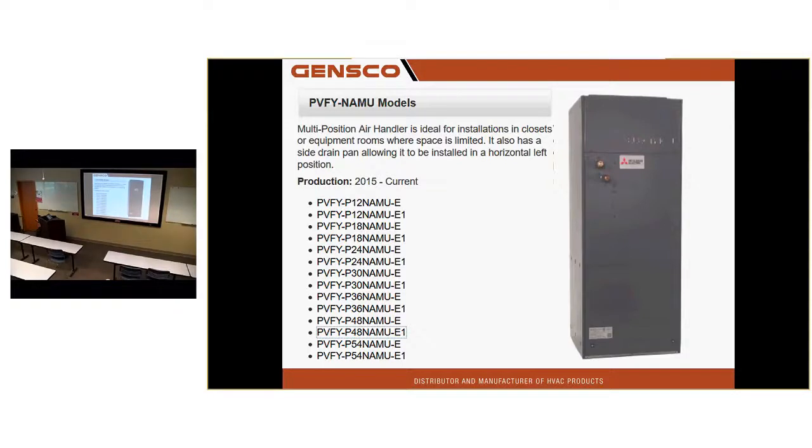The entire upper cabinet has 1-inch foam insulation, and the blower compartment is wrapped with bubble wrap, so you can pull the blower out and clean it easily. All the screws have a plastic backing on them so they won't rattle. And the screws for the blower door and the electrical cover door have spacers. You cannot over-tighten them and crush them.